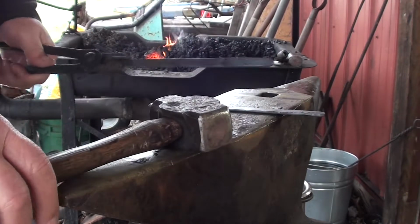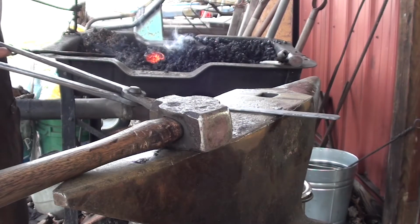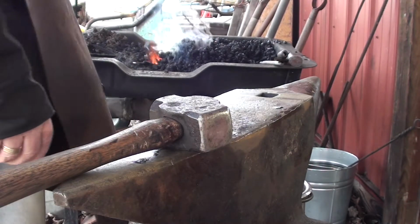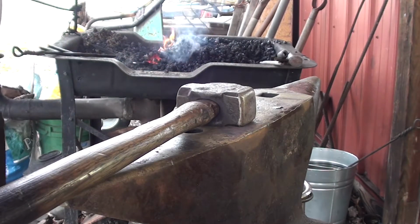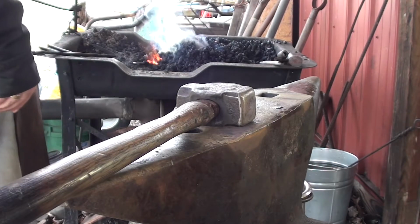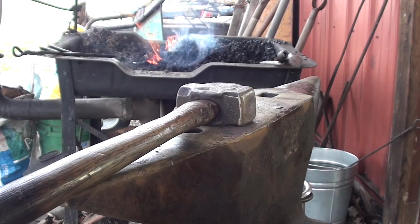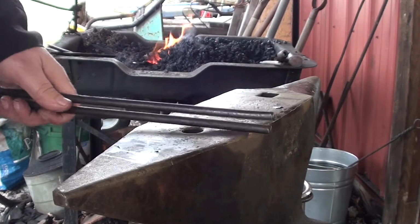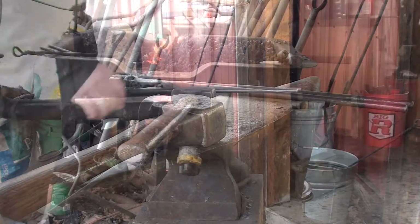Now I want to fuller that right behind that to make like a ball on the end. And for sure, a person could use a lot of different methods to fuller it. Could easily use a blacksmithing magician, could use a spring fullering tool, but another simple method that anybody can use is the reins from a pair of tongs. These happen to have 3/8 inch rod forge welded on them. That's what I'm going to use. Put that in the blacksmith's third hand.